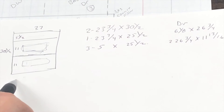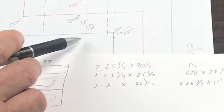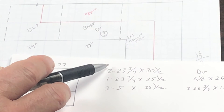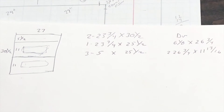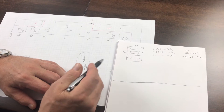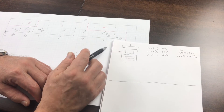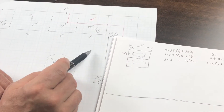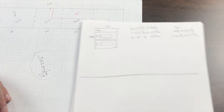This gives me my cabinet and drawer faces — all the information I need. My crude drawing comes from the information I gleaned putting my layout together: I know it's 27 wide, 24 deep, and 30 and a half inch high. I've transferred all that into a shop drawing and can go to my table saw and cut out the cabinet and get ready to assemble. Now we're getting ready to draw the cabinet in a face frame style. The first thing we always do on a face frame style is actually draw out the face frame, so let's start there.